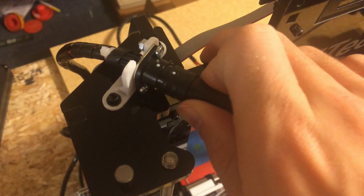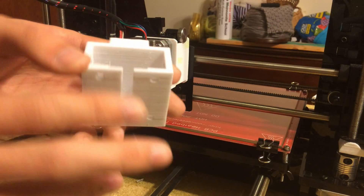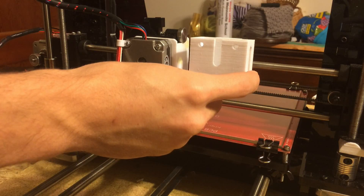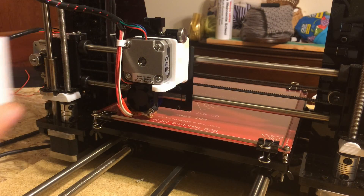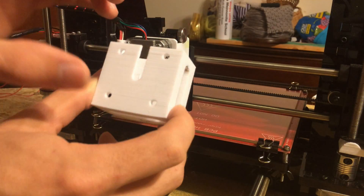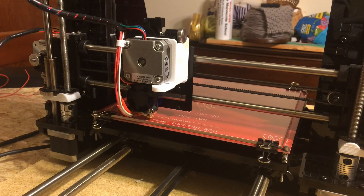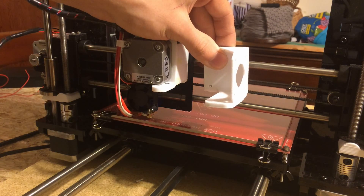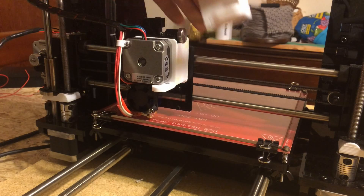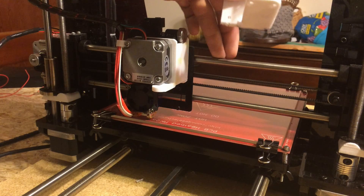With all of the major components decided on, I needed a frame to complete this printhead. At first, my idea was to put the motor in the rear, nestled right against the X guide rods, similar to my PrinterBot Simple's design. On further inspection, however, I noticed that the slop in the X carriage caused by the Chinese tolerances was being amplified from the nozzle hanging so far away. My next plan was to mount the motor and extruder sideways, very similar to E3D's own design, but it took even less trial to see that this was not an option, as the extruder gear was getting in the way.